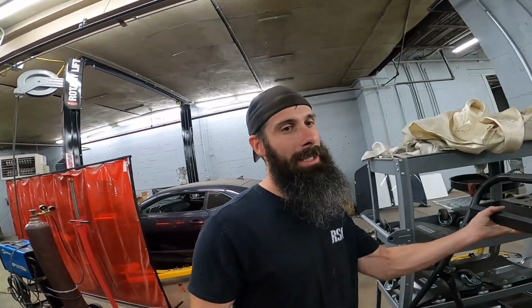So we're going to start at the back of the car. A lot of you know on our website we sell large vent tanks. They're designed to mount in the trunk, and this allows a large volume of crankcase venting, plus if it ever decides to dump the whole contents of the motor into the can, these cans are big enough to hold just about everything that's in the motor. Plus it puts it behind the tires, which is the main thing, because you don't want something puking out underneath the hood causing a fire or getting under your tires and causing you to hit the wall.